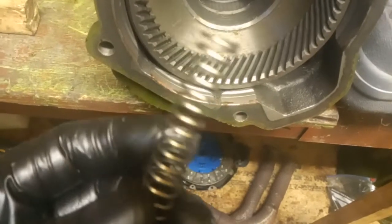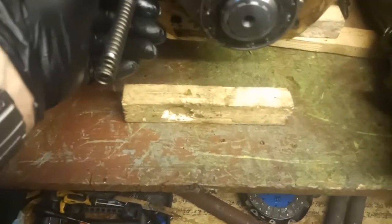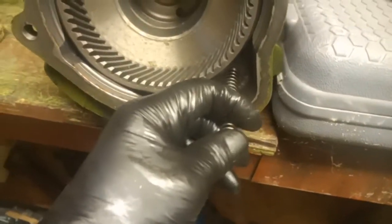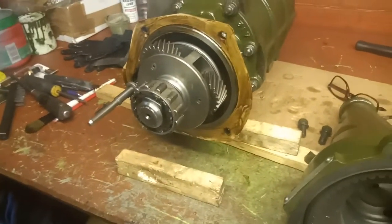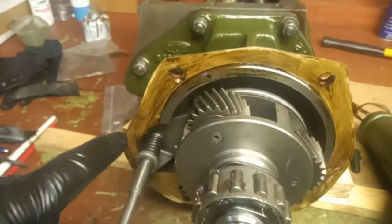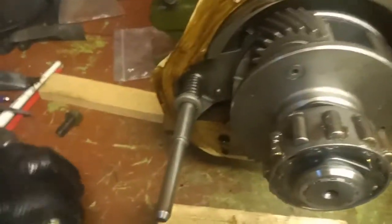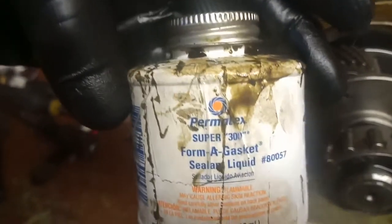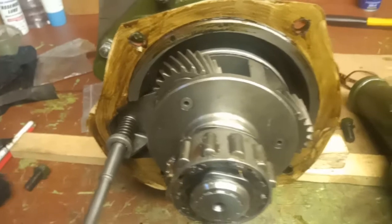This is the spring I mentioned — it sits on the end of this pin here. The lockout rail keeps pressure on it to keep it up to that end. After trial fitting I decided to fit the spring first into the hole because it's easier to find it in there. Also, the gasket I've made myself — I've coated both sides with Permatex instant gasket. It's very sticky and it stops it from flopping down, which makes the job even more difficult.